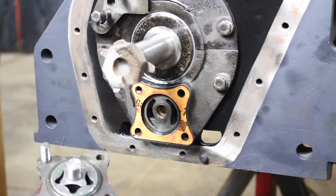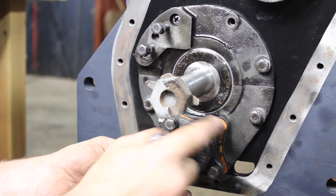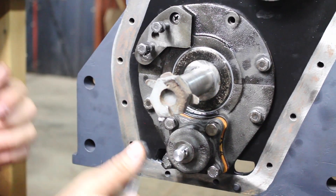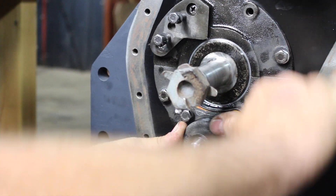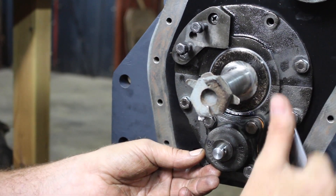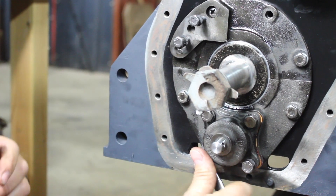Here's our little oil pump which goes onto there. Get all the bolts started before you do them up. You can get a ratchet in here — I haven't got one so I'm just going to use a spanner for the minute. Do them all up evenly so everything gets pulled together nice and even. This is our Ferguson 23C engine — the later engine to the 20C — but it's got exactly the same oil pump.